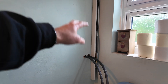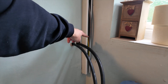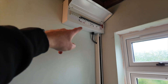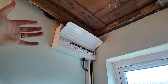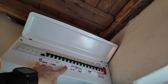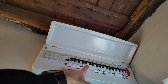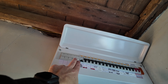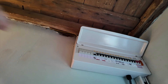So we're at this stage now, we've got two armoureds coming through — a 16mm and a 10mm. The 16mm is to the big barn, the 10mm is to the triple garages. We've now got to get into here, so we're going to open this board up. There's also a breaker I noticed here — the second floor lighting — which actually ran at 16 amps. We're going to change that as well. And there's the old hot tub supply; I don't know what's going on with that, I think that's gone. So we're going to be putting two new RCBOs in here to take care of those.